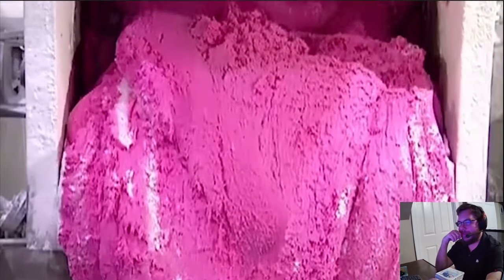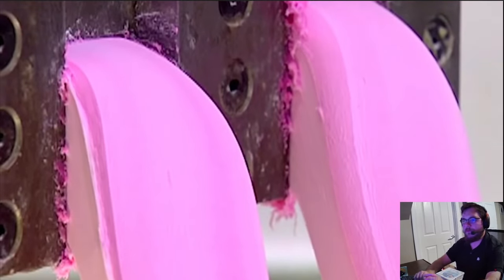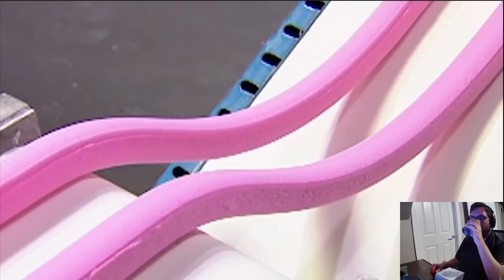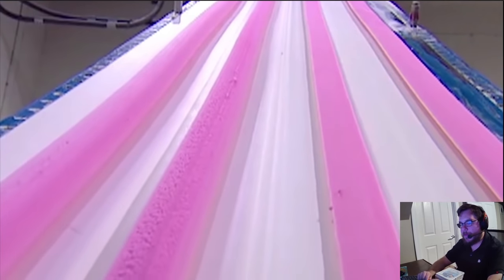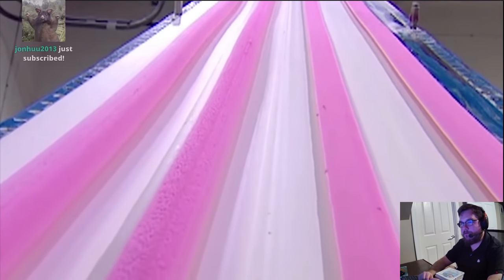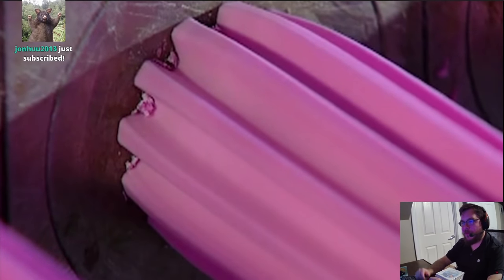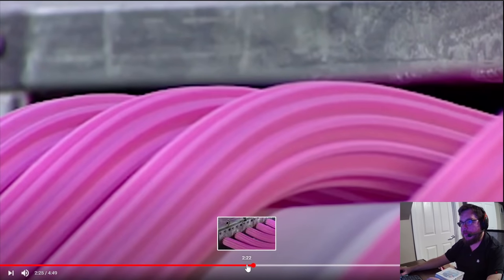They transfer it by part to a machine called the pre-extruder. The machine squeezes the mixture through a narrow opening, like squeezing toothpaste from the tube. This transforms the big, bulky wad into thin, manageable strips that can then go through the extruders. The extruders squeeze each strip down to the actual width of a piece of bubble gum. It comes out as one long, continuous stream to be cut into bite-sized pieces later on.